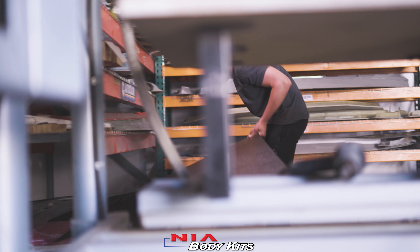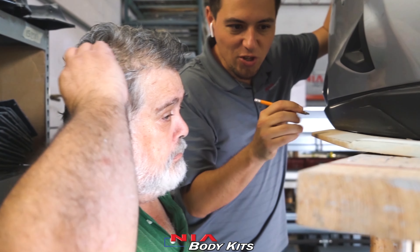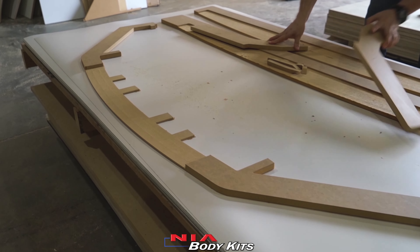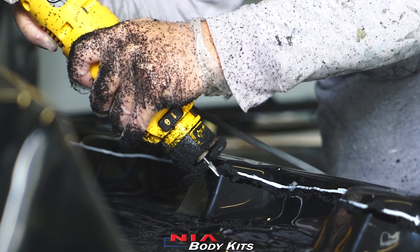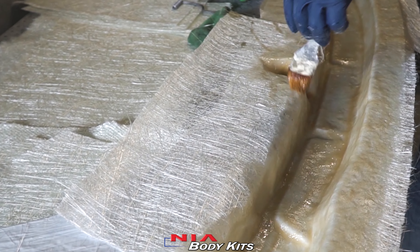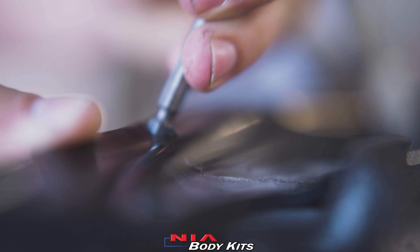For many years, we just had one kit for sale. And I found out about these thermoform machines. One front lip would take us eight hours to make. With the thermoform machine, once the mold is done, it would take us 30 minutes — we can actually do a few of them in one day instead of just one. But the hard part was trimming them. We would air saw, we used a whole bunch of different machines, and then we finally found a cutout tool that's used for sheet rock. Nobody's hands are perfect, so you see all the cuts. You'd have to get them back, sand them down. So the kit would take 30 minutes to form and then another two or three hours to shape it and make it perfect. We're making more models, more kits, and it came to a point where even three hours for a kit was too long.